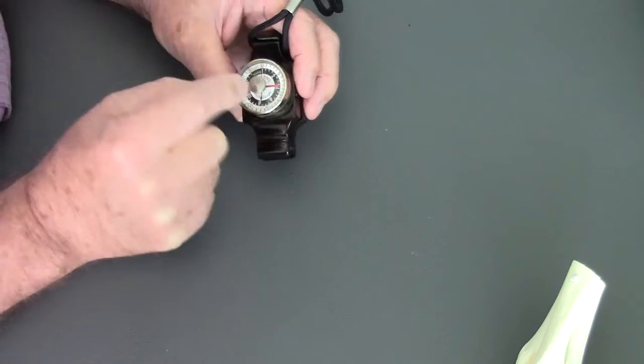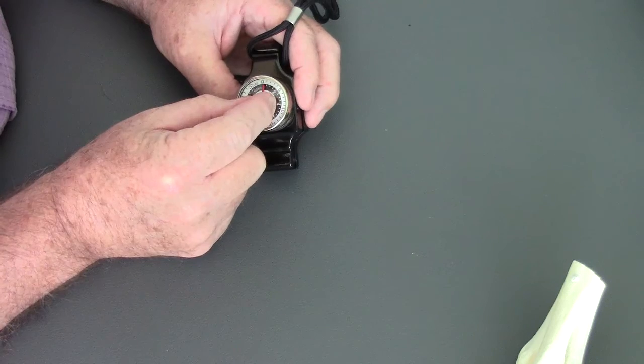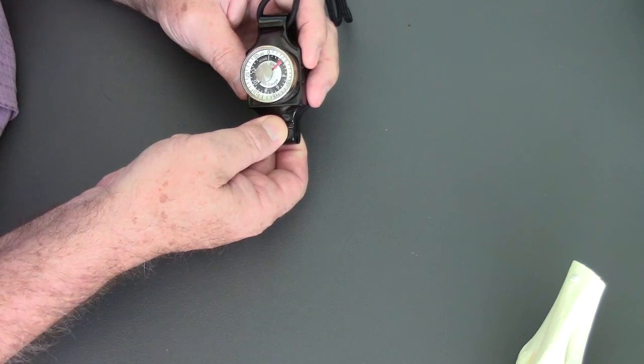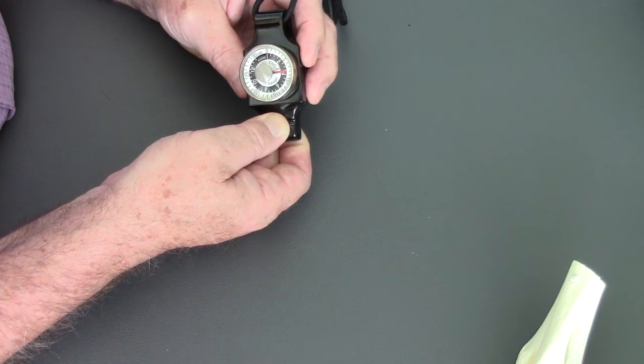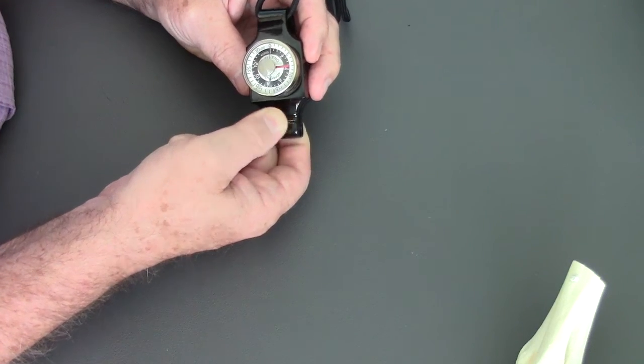And then I would do a spring mobility test going to 8 pounds and letting it come back to 5. I hope that you can see the small thin black arm that moves. Okay, so when we take up the slack at 5, you see the red arm, and then when I go to 8 pounds and come back, of course the red arm is going to stay at the higher number, but you should be able to see that black needle travel from 5 to 8 and return, 5 to 8 and return. Very good.